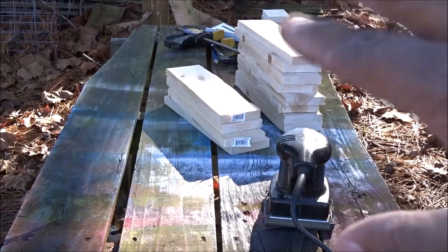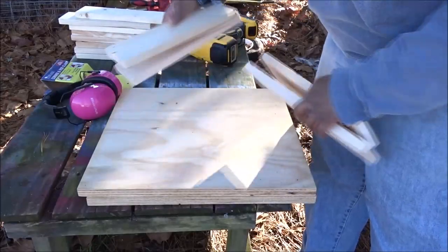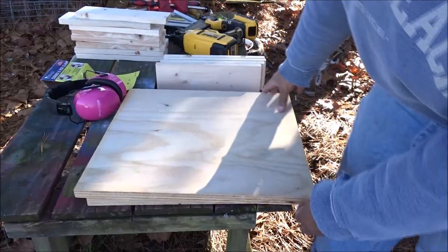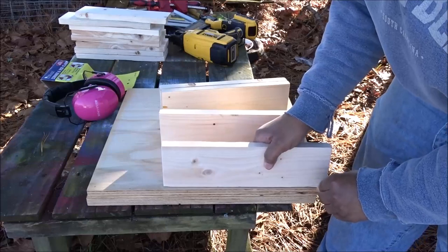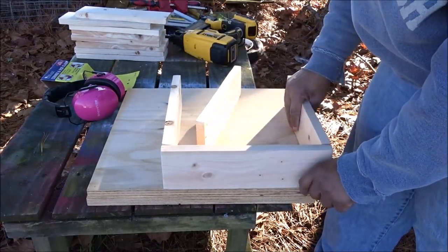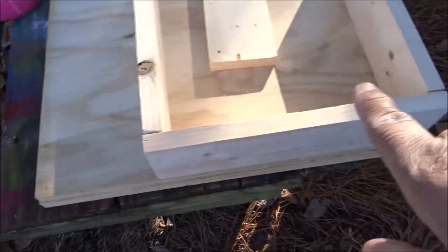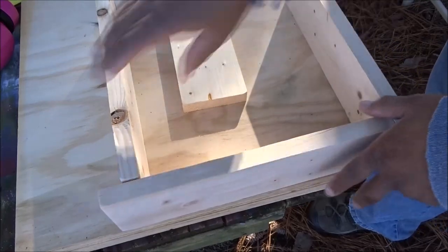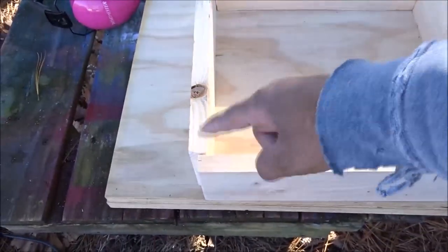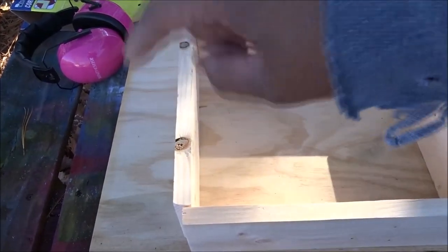I have all my pieces cut. Now I'm going to use my sander and sand down the edges, just to give it a nice smooth finish. I have some scrap 3/4 inch plywood that I'm going to use for the top and the bottom. So I'm going to lay my boards out — now this is important, guys. You're going to lay them out however you're going to arrange them. Whether you're going to have the ends butt up like that, or if you're going to stagger the ends. So once you get that figured out, then trace around the outside and cut out for your top and your bottom.